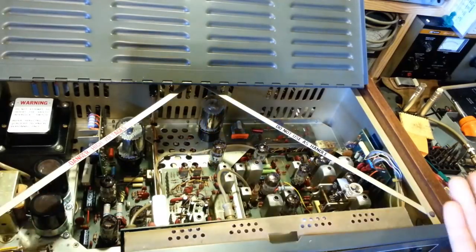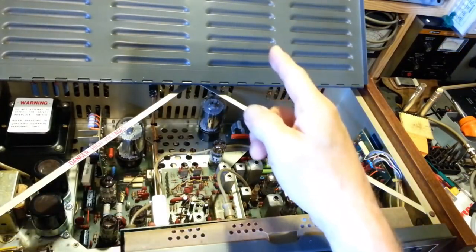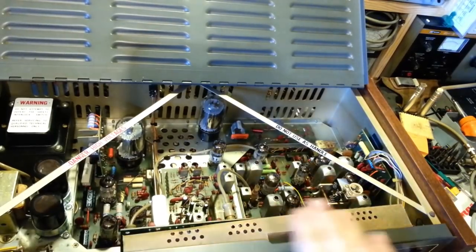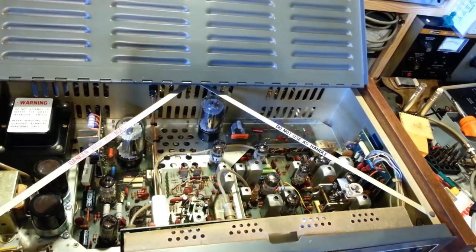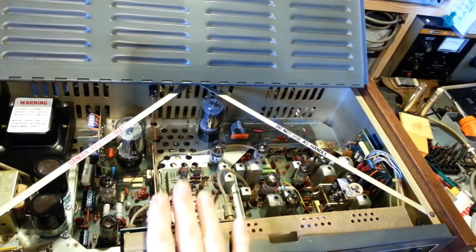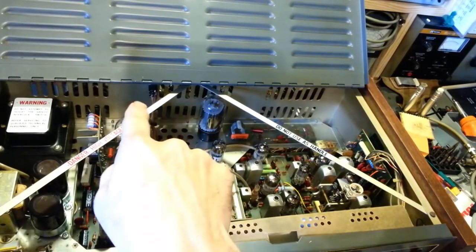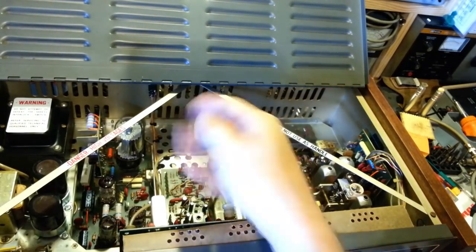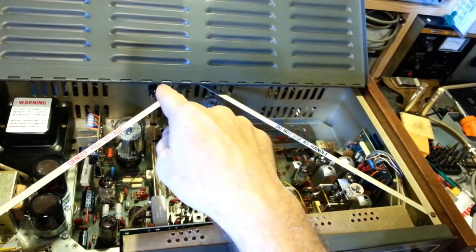So you'd seen the inside. Like I say, that's about the only thing I've done, put the end caps, the bottom, and top covers on. Put the reflector back in for the meter and control. Let's see. Replaced clarifier. I did end up replacing one crystal in this. It actually has a lot of crystals that are out of spec on this. But like I say, it has that switch. Left that in. Just tied the wires up neatly.